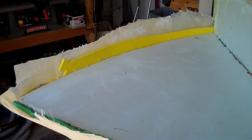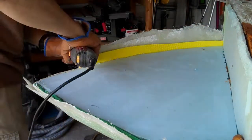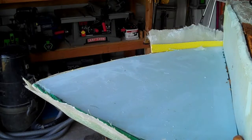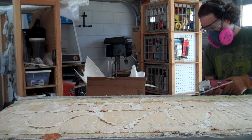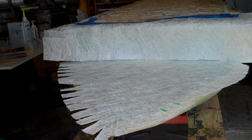You can see here how I extended the foam and the fiberglass well past the actual top surface, so I didn't need to be terribly careful about the bottom edge — all of this needs to be cut off flush. I find that an oscillating cutoff tool is perfect for this job. I used a drywall disc for most of the work combined with a one-inch square plunge cutter for detail work near the edges. Expect your blades to dull faster when cutting fiberglass than wood. I'm cutting at a slight downward angle from the foam, which will shape the top surface.